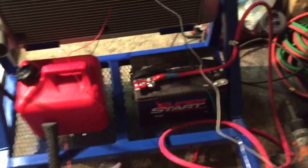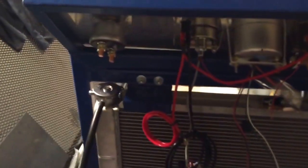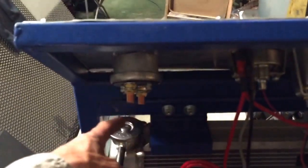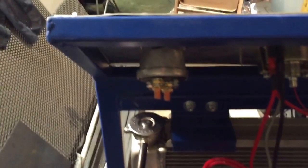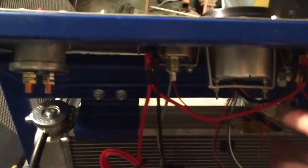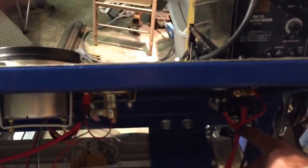So yeah, next big step is wiring. Right before she left, we started the wiring. We're gonna run our primary power run up to our master cutoff switch here, and then we'll take our power off the other side of that switch, some of which will go to the ignition switch, and then ultimately the ignition switch will power all our gauges.